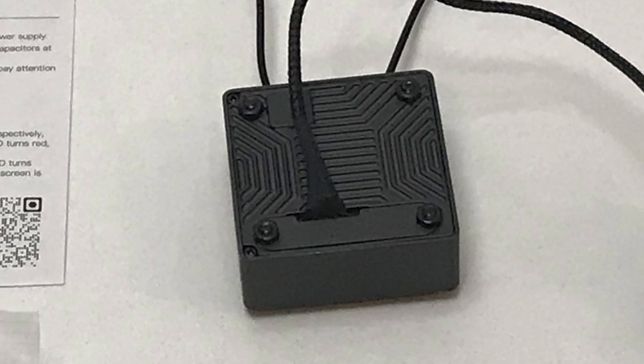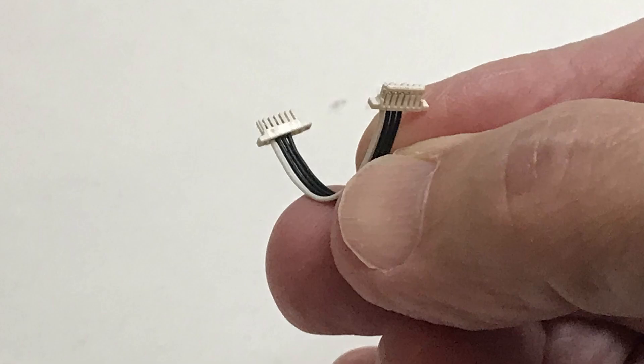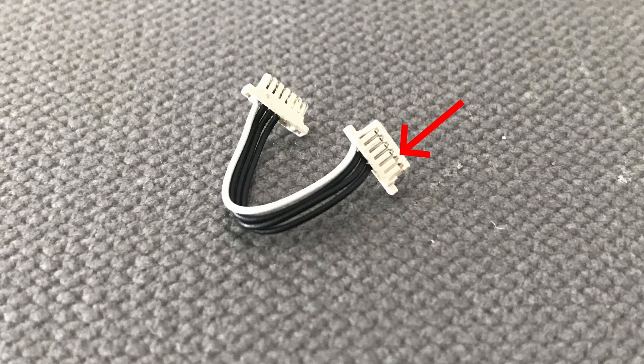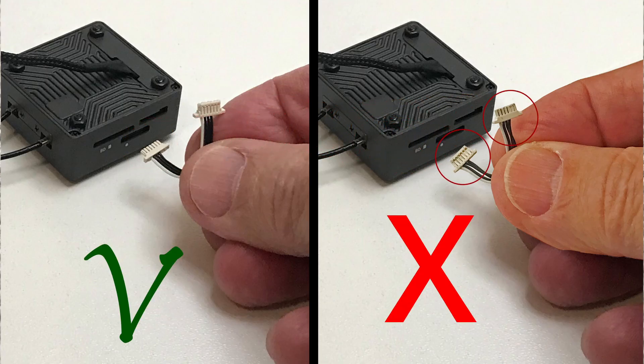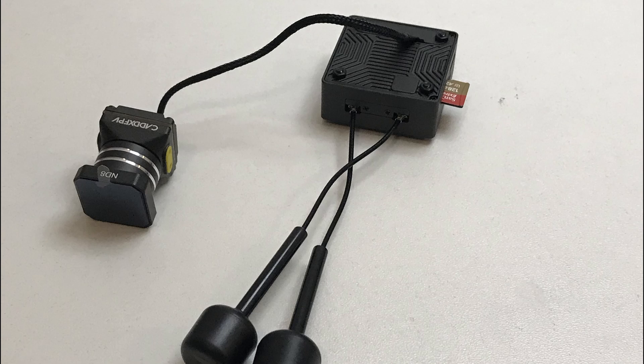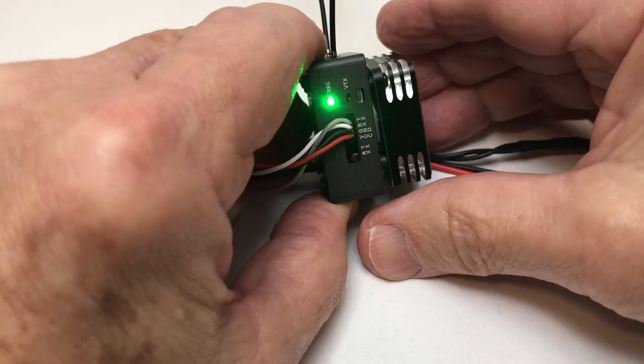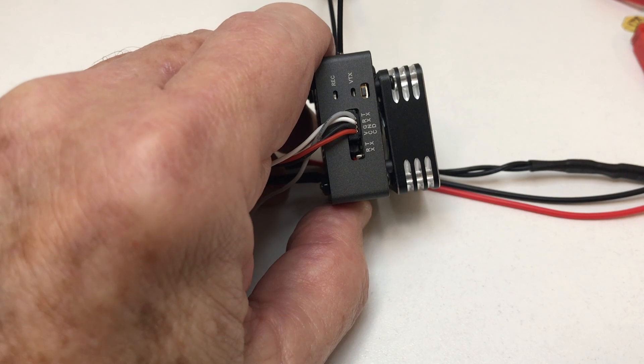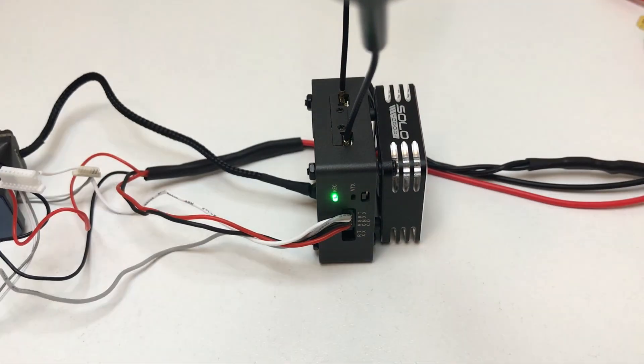The upgrading of the VTX is a little trickier, since it requires a USB cable to connect the transmitter and the recording board of the VTX unit, and it can be misleading how to connect them to the respective ports. The instruction from the manual indicates aligning the white cable with the white dot in the port. However, it is equally important to ensure the connector's tiny holes are aligned with the port's pins. Due to the small size of the connectors, even aligning the white cable with the white dot, the USB connectors could be switched around, causing potential damage to the internal pins. Now copy the upgrade file to the root of the VTX SD card. Power up the VTX and wait for the green light to flash. Press and hold the linking button for 8 seconds; when the indicator light turns red and flashes, release the button. After the upgrade is successful, the VTX light flashes green and the record light turns solid green.